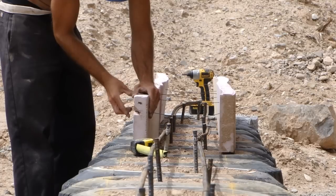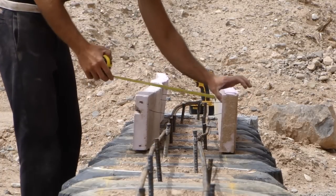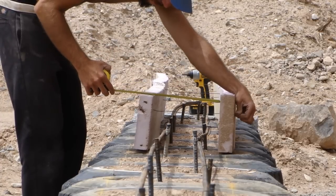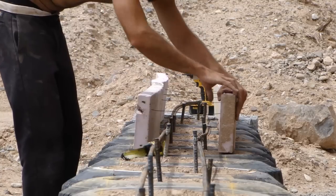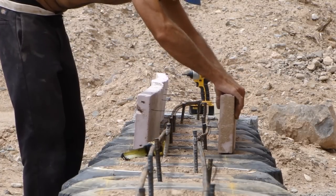Like if you were doing a wood form, you'd take the wood off. In this case, we're just going to leave that insulation on there and that ends up insulating the bond beam. I'm just measuring the form to make sure it's 10 inches wide. The pieces are already cut to 8 inches high and I'm securing it all with some rebar tie wire.